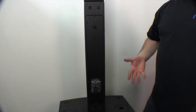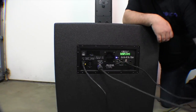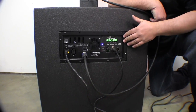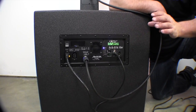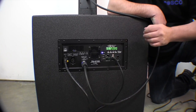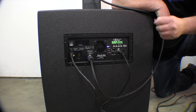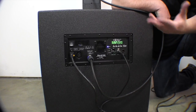And then you combine this powerful subwoofer. You're looking at a 2,500 watt active subwoofer down here that plugs in via Neutrik connection to the top packs. On here you've got your display. Your display goes through different variations of what hertz you want to cross this over at. I believe it starts at 63, all the way up to about 160, 180 hertz, where you can cross over the sub. You can also do a sub boost. We tried it with and without the sub boost. We could hear a little bit of a difference, but not an extraordinarily huge amount. When you turn it off and turn it back on, all the presets are back to normal. Wouldn't you say that's how you explain it?